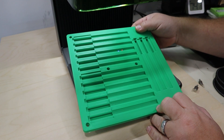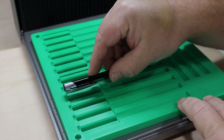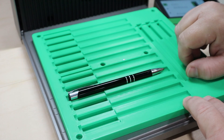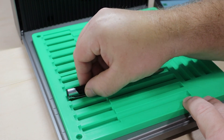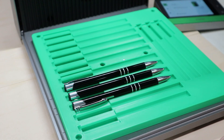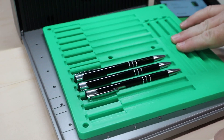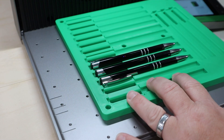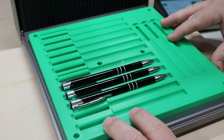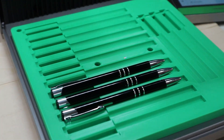Looking specifically at my pin jig — this is designed to hold 15 pins for engraving and to hold them in various different layouts. This jig lets you orient it one way, you can also rotate the pocket clip that way, and if you want to do the back it will recess straight down face-down into the jig — that's why I call it the universal pin jig. In this example I've got some pins, my jig is still floating. My recommendation: move it over to where the pin is right below your laser, raise it up — right there, now we are in focus with the top of the pins — then move it over and lock it in however you want.